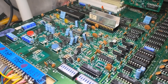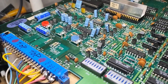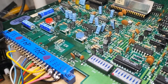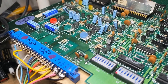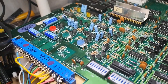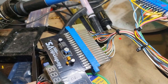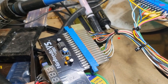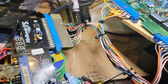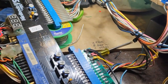Well, after messing around with the video circuit here, I tried a couple of different things. I tried to create a sync stripper, and I tried to create a positive sync to negative sync adapter, and nothing was working with this. But luckily, I did come across a Nintendo Versus PCB. That was an adapter that was given to me by PCB Junkie, and I decided to wire this thing in instead. Luckily for me, he has already created a video circuit for this.